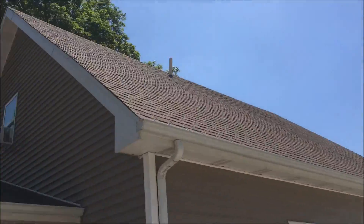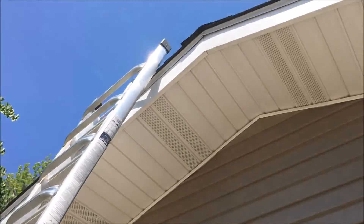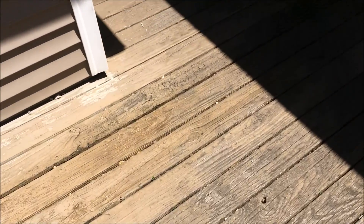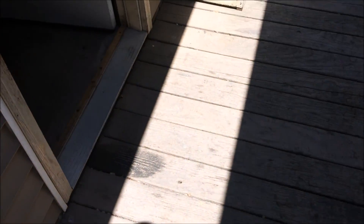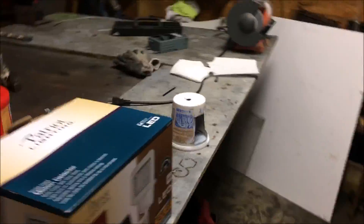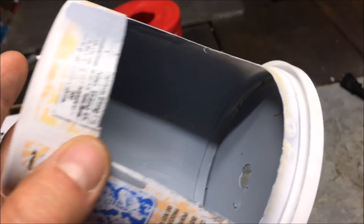As you can see in the sky, I have tree lines all over. In between that tree line and that tree line is about right here in the sky — that's not going to be high noon; that's at about two o'clock in the afternoon when I'm actually going to sync up that solar panel, because high noon is not the very middle of my available sunlight due to the way the shadows are cast. That's one thing you might want to take into consideration — where the Sun actually is. If you're out in an open field, go with directly south at high noon or right around one o'clock.